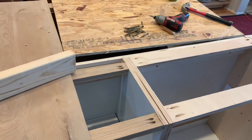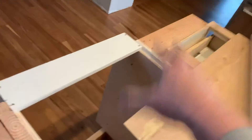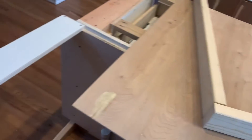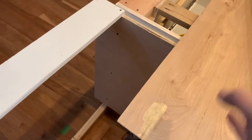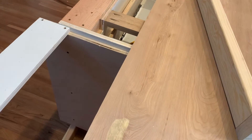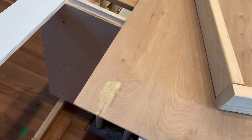My plan is to learn how to cut through that countertop and install a kitchen sink — I've never done that before. I'll lay it out on a template and cut the straight edges with my circular saw, because I can handle that and it gives a nice clean cut. Then to finish it off and do the angles or the curved corners, I'll use my saber saw.